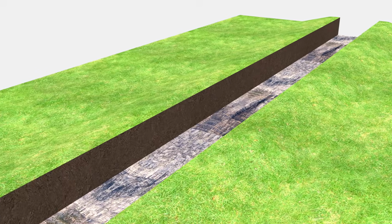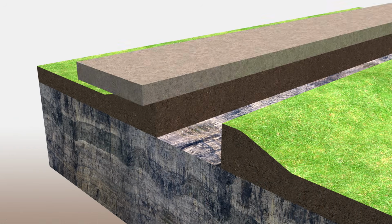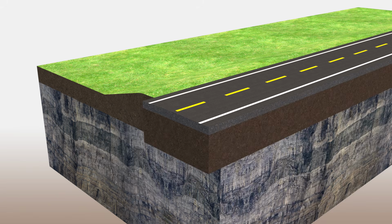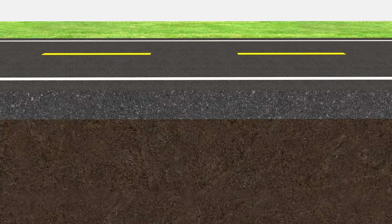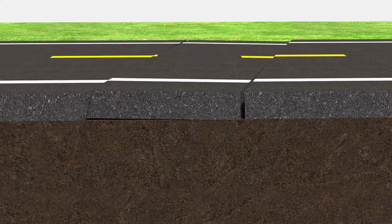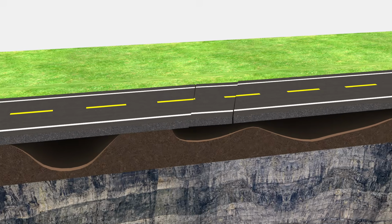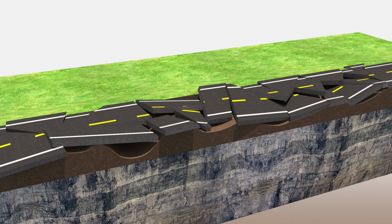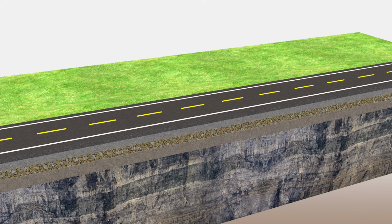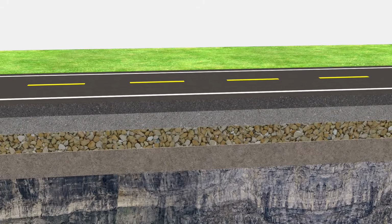After planning and earthwork is done, highways will be constructed with multiple layers. The reason for using multiple layers is to prevent erosion in the long term. Without multiple layers applied, when the road cracks, water comes in, soil comes out. In the long run, when losing too much soil, roads will be broken or even collapse. That's why having multiple layers will prevent a large amount of soil from being eroded.